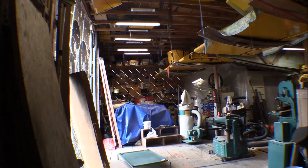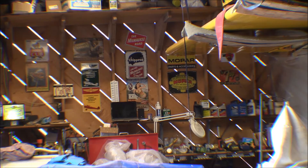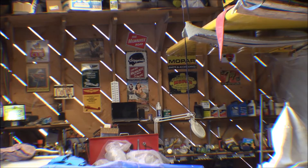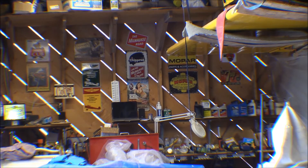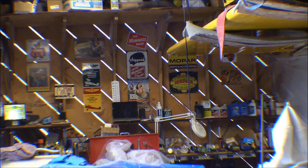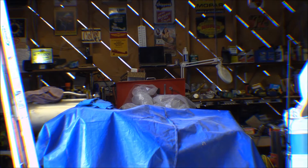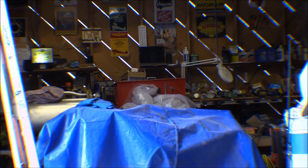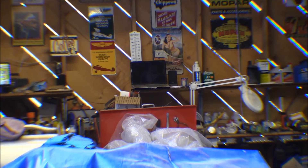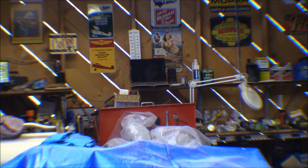This is my hangar — the far side over there shows the construction. It's two-by-six spruce that came right off the sawmill. I built frame walls for it: one wall on that side and two walls on this side — that one is 14 feet long and 12 feet tall. The front of the building is 15 feet tall overall and the back is 10 feet tall. I sheeted it the next year with one-by-twelve spruce, also off the sawmill. You can see the gaps there where light comes through — when it was put up green you couldn't stick a dollar bill between those boards, that's how much they've shrunk.